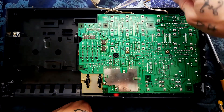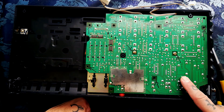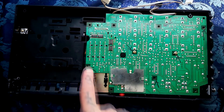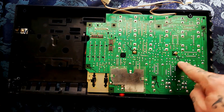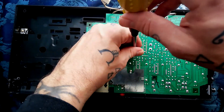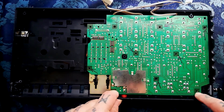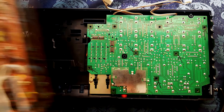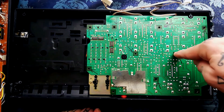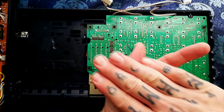If you're having any kind of intermittent problems, low signal, and so on, I would tend to clean the mixer before going into calibration, signal tracing, recapping, or any of these more complex and time-intensive processes. There are going to be six screws — I've got Sharpie pen arrows pointing at them. Sometimes you need to mark up these boards to distinguish between holes where the screw goes directly into the back of the PCB and holes which are sandwiched between two plastic layers.